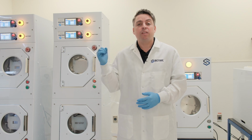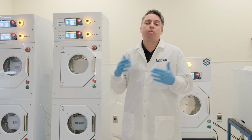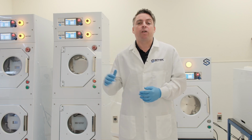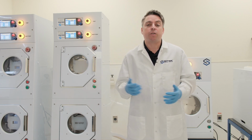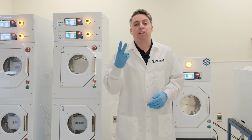If you drop down in line size, the system might be able to build up pressure while in idle, but then when it runs, it's going to have a pressure drop and you're going to have alarms that'll prevent you from running properly. So with nitrogen, don't tee off your lines and maintain the line size.